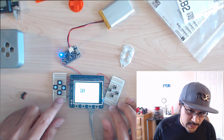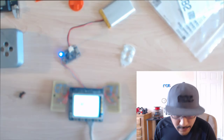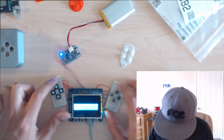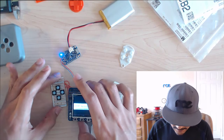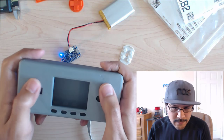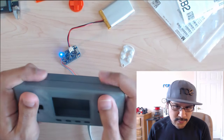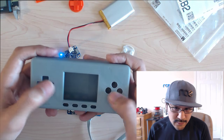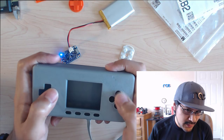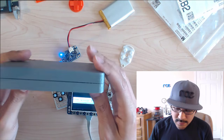This is just prototype phase. I will be designing a custom PCB for the buttons to reduce some of the wiring, because you can see quite a bit of wiring. We can do a little bit better with a custom PCB - and really the main thing is I want mounting holes and I don't want to drill holes into these. There really isn't enough room to get this mounted the way I want in the enclosure. This is the updated enclosure - there's still some edits to do. Mainly adding a switch, adding shoulder buttons in the back, and moving the button groups up, because when I hold it my thumbs naturally want to be right up there.